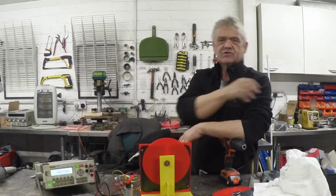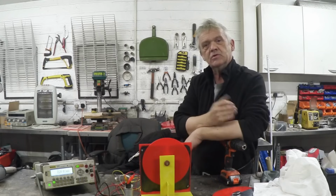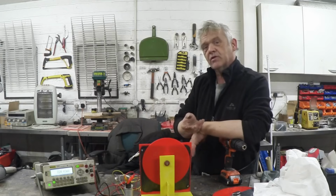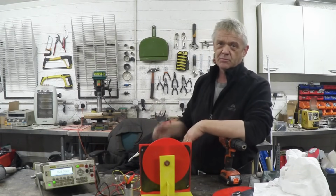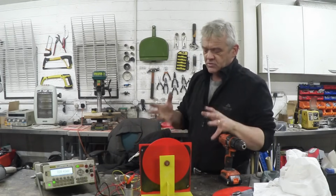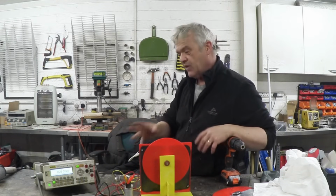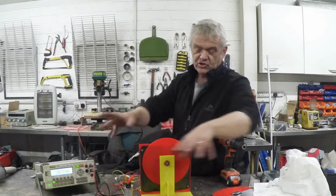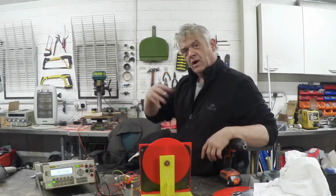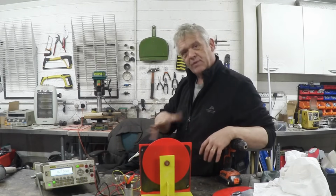Now, we made this in exactly the same way as we did in video 1340, the only difference being instead of using aluminium, we used our conductive ink, and it works, if anything, slightly better. Now, you've got to remember this is an electrostatic machine, so even though the voltage is quite high in these terms, it will be a very low amperage. What we need to do is have a look at that. But it looks to me like this idea of printing an electrostatic generator has moved one step closer. We've taken the flag circuit, attached it to a standard electrostatic generator, converted that to a printed or painted electrostatic generator. The next step is just to get a bit more involved with that.